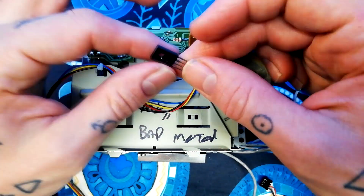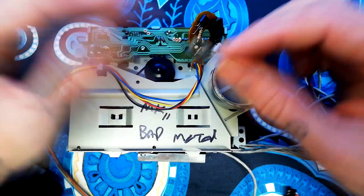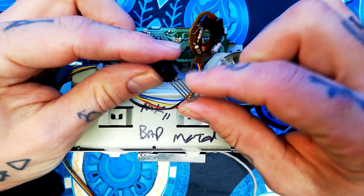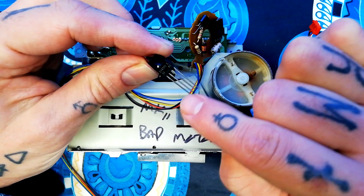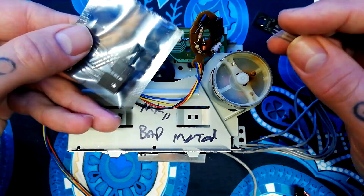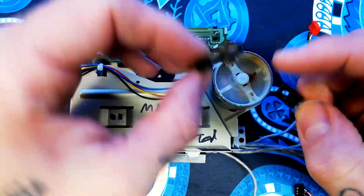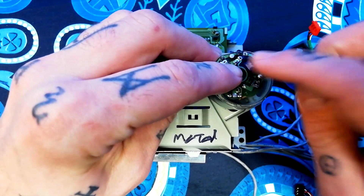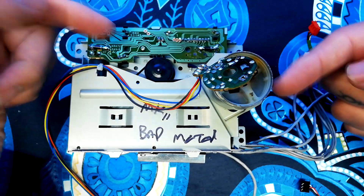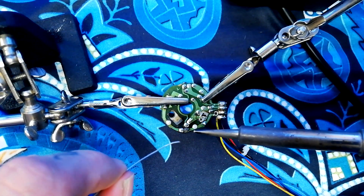I'll put a link in the description — I've done quite a long blog post on my website about the way I approached trying to figure out how to refurbish these. I found that the chip on this is a C1470H, a motor control chip by NEC. It looks like a voltage regulator but where a voltage regulator would have three pins, this has four. I've been able to obtain some new old stock, so what I'm going to be doing is soldering this back in, reattaching the servo PCB to this motor, putting the brass spring back in with a bit of thermal paste — the kind you would use when mounting a CPU into a computer — and hopefully that brings it back to life.